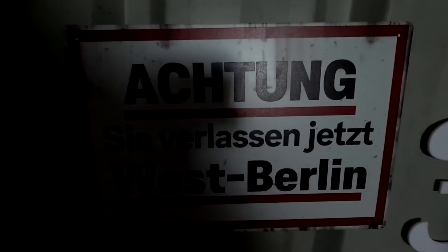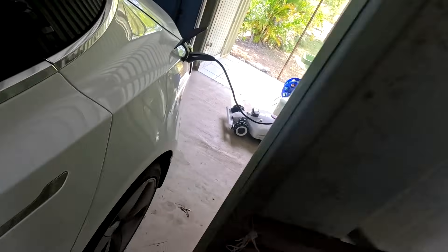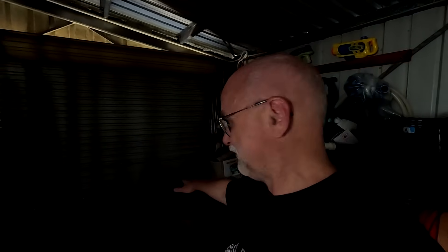Close this and give it an extra push from the door — that's all the way down. Can't see any light coming through anywhere. So far this video from today is sealing up the bottom floor track situation — the floor seals. It was a bit of a mission. I still got WD-40 on my hands — washed them a million times with all kinds of soaps and I still smell like an automotive mechanic. Just in case you want to seal your garage door as well, I'll link all this material down below. You can buy these floor seals and door seals on Amazon and eBay — they come in 3-meter and 6-meter lengths, so for one or two garage doors. Some of them come in a set with the adhesive already included. Very handy and very straightforward.